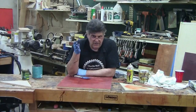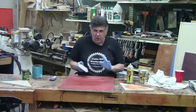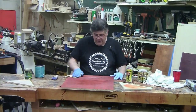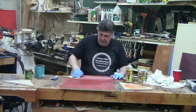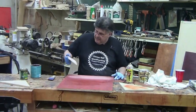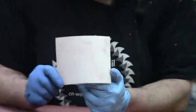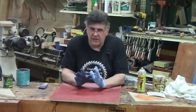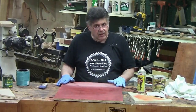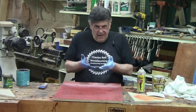In the run segment, we'll teach you how to deal with that. There's another thing called color migration — that's also part of the same issue. I sprayed a little bit of water-based finish on this, and when I scuffed my first coat, I'm getting a little bit of pink. Reds seem to be worse than any of them. What's happening is that the water-based finish went on, softened up the water-based pigment, and it migrates up into the finish.